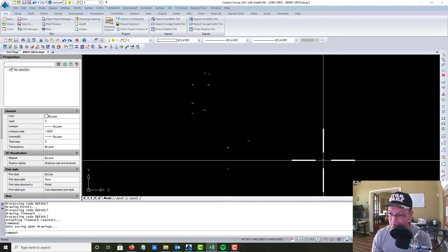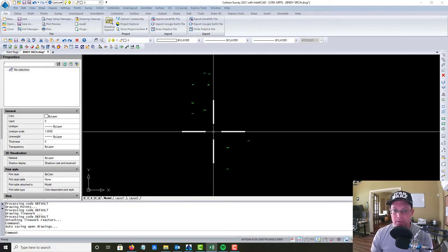Almost everything we looked for was in a centerline monument well. There were a couple of points we found that weren't, but almost everything was. Okay, so we start with a search drawing, and everything in the search drawing is record, even if there are gaps and overlaps. Then we take our search drawing and convert it into a boundary line work drawing, which has the resolved line work, where we may not hold record. We may hold monuments instead of a record measurement, or we may hold one record over another in the event of a conflict. So hopefully we'll get into that. I don't think it'll be this first video, but.